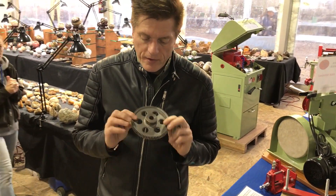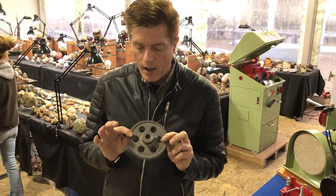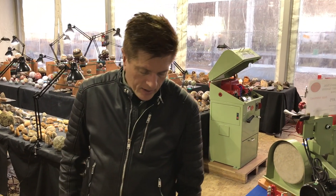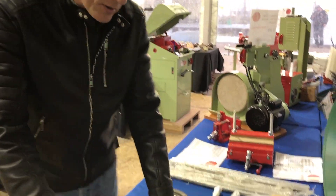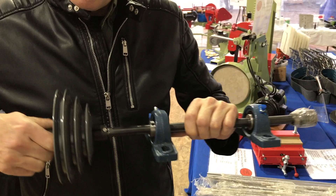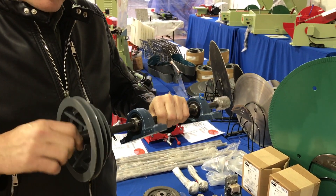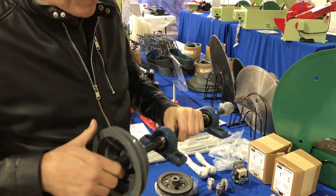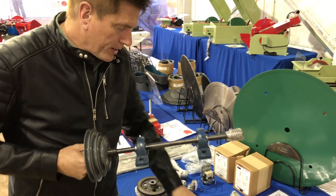What we've done is we've cut brand new gears. We did molds and castings. We've got gears in stock, and also the crossfeed shaft. Many of you — this all is locked up on your saw, so you can no longer change your belt. So we have replacement shafts and replacement pulleys for the step pulleys.